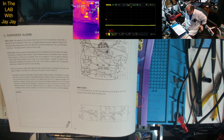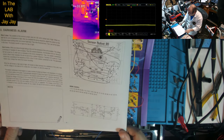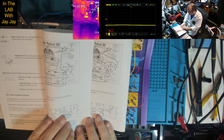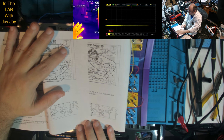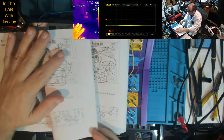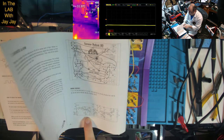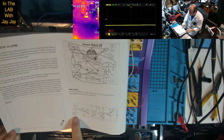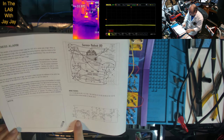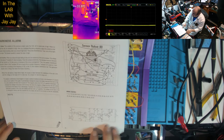Should we have a look at the schematic? All transistors are NPN. Here's how they're wired for the brightness alarm, and here's how they're wired for the darkness alarm — what's the difference? There's no difference in the multivibrator, which makes sense. The thing that's changed is the point at which the CDS cell injects its resistance. The Darlington circuit, the multivibrator, and even Q5 are all exactly the same as in the previous circuit — but the location of the CDS cell has changed. Fascinating, that explains it.